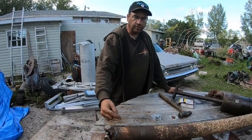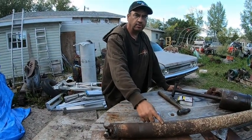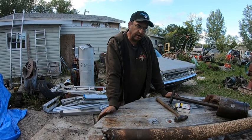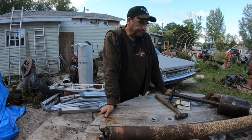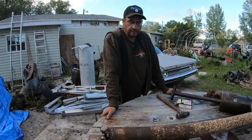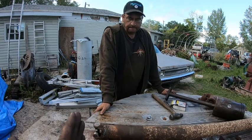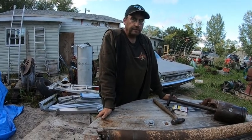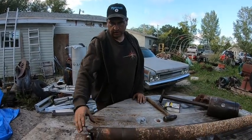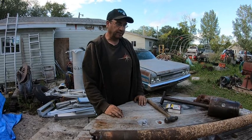Inside, which we didn't show, from the forming of the drive shaft tube there's a little ridge, so we just had to grind that out to fit this in there nicely. You just gotta watch out for stuff like that. But it's fairly simple. You could do it without a lathe, but you're getting into issues. The bigger thing is cutting it straight. If you put it in a chop saw, you could do it. Then take your time and grind this out. It can be done, but it was actually fairly easy. The thing that took the most time was Derek setting up the lathe. That's about it.